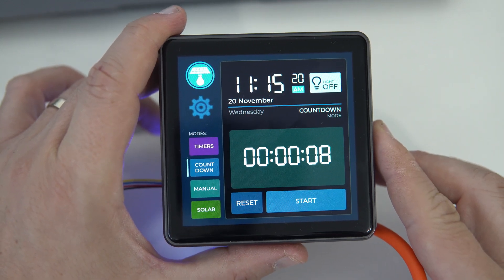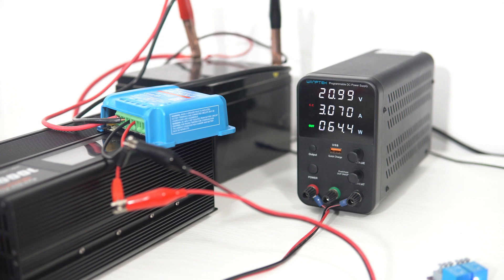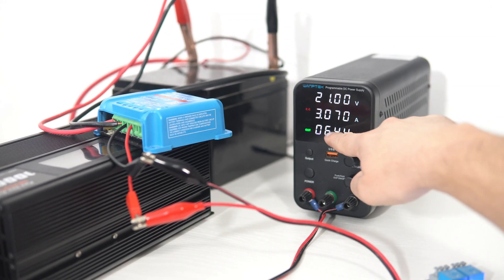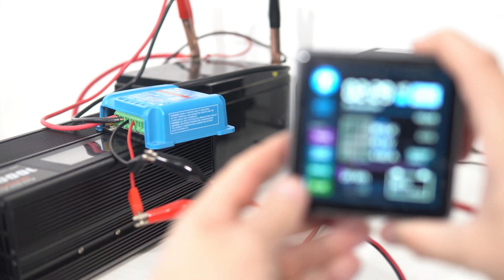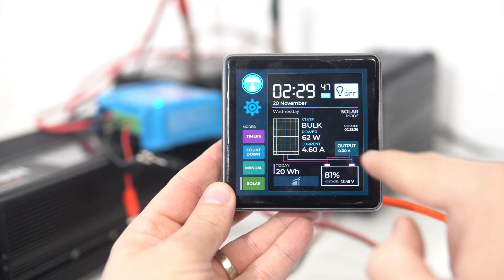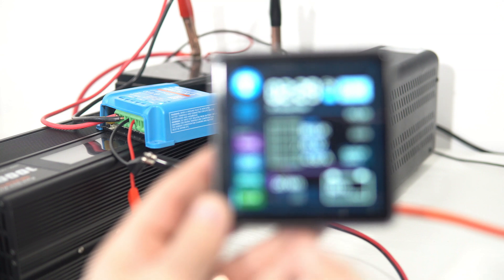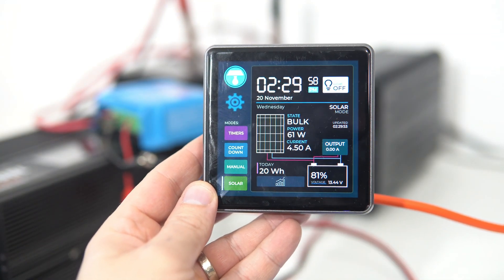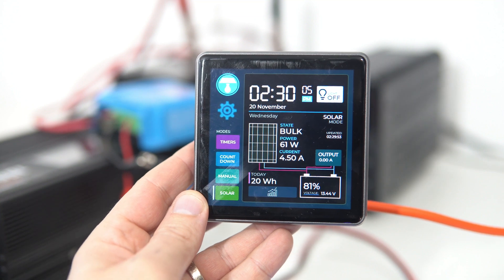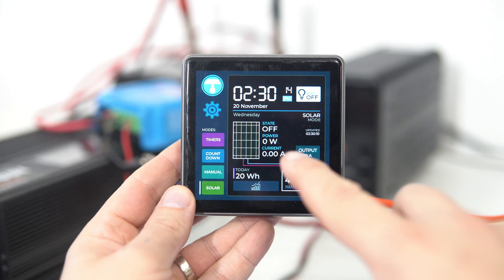After using plenty of mutex and other tricks, the system became stable and reliable. Today is a rainy day, so I connected my power supply just to show you that the system is working — and now I'm charging my battery with 62 watts, or 4.6 amps going into the battery. If I turn off my power supply, after 15 seconds — because this system updates every 15 seconds — we will see that value drop to 0.